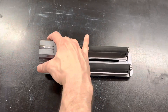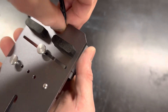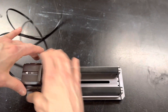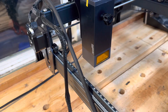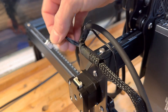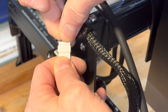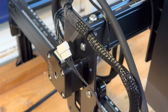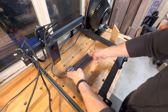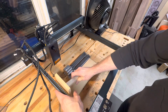Then you adjust the position of the motor itself so you have proper tension on the belt. Next you want to connect the cable to the stepper motor. Because I'm using an Atomstack A30 Pro laser, I'm going to use the Atomstack cable, but the kit also comes with a different one for other brand laser engravers. To use the R2, you first remove the Y axis connector from the stepper motor, then connect the Y axis to the R2 roller. Next you want to make sure your roller is exactly parallel to the X axis.